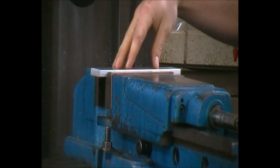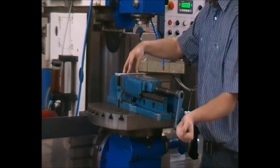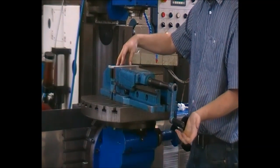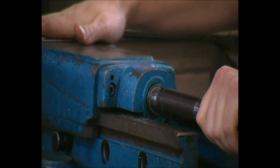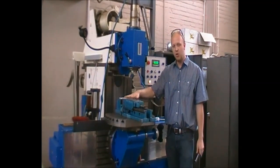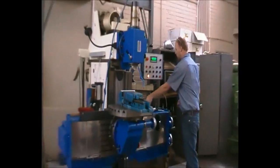Place the parallels upright into the chuck, place your part so it is positioned correctly, and then by means of the handle tighten your part. It has a first-stage mechanical and a second-stage hydraulic mechanism. When it gets a little push, two lines will indicate that it is hydraulically clamped. Make sure the faces being clamped are parallel and have the best effective grip possible.